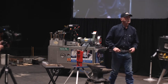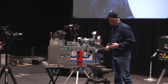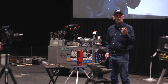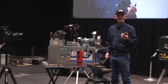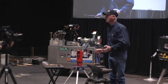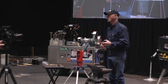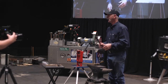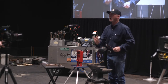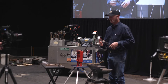I got a pair of 3/8 tongs, with a piece of 3/8 in there. The guy's helping me put this thing on. I wanted a short piece, a light piece. I'll take a horseshoe and chop it off with the chop saw, so I'll have a little bit of a piece. I don't want the whole horseshoe. I want no weight out here when I'm setting. That makes sense? Because if I have to grip to hold the weight up, then I'm going to screw up what I'm trying to do here. So I want a very light little piece.